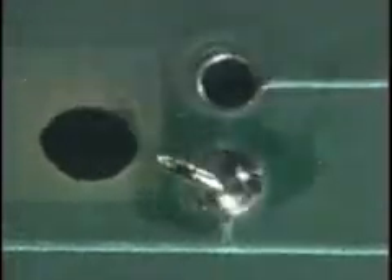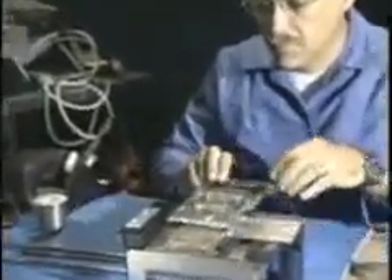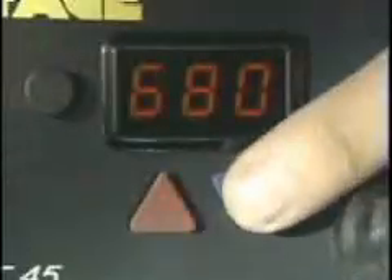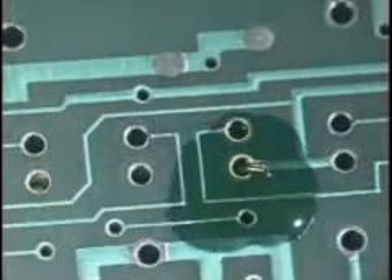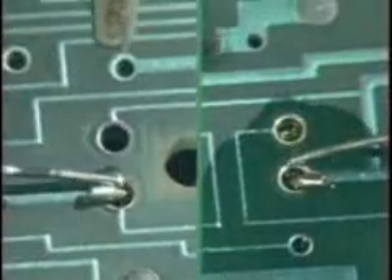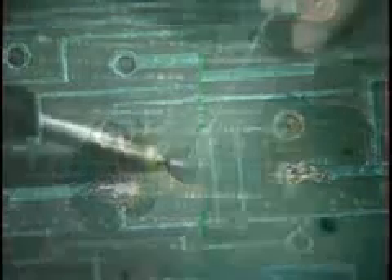These situations can result in incomplete solder flow or solder that appears dull and grainy. To overcome this, many operators increase the temperature setting — however, this may result in damage to the circuit board and lifted lands caused by high temperature over an extended period. The final variable for tip selection is tip length and shape, which allows easy access to the area to be soldered. Using the wrong tip on a densely populated assembly may damage adjacent components. Many operators get comfortable with one tip style and become reluctant to switch, prioritizing time over quality. Remember: let the connection area dictate the type of tip you use.